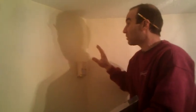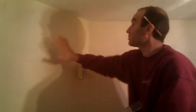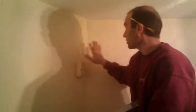So, like I've said before, that's really like putting 2 coats of putty on in a traditional sense. We've got our tape in, and we've got our fill coat on. The last coat is our finish coat, which will kind of smooth everything out. We'll do a little more feathering at the edge. And after that, we're going to do our sanding and painting, and we'll be done.